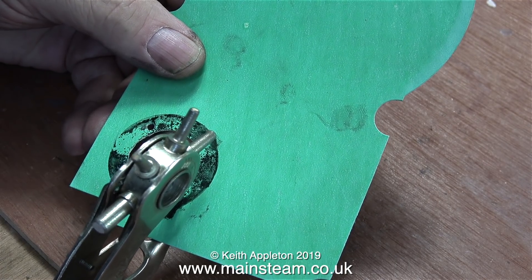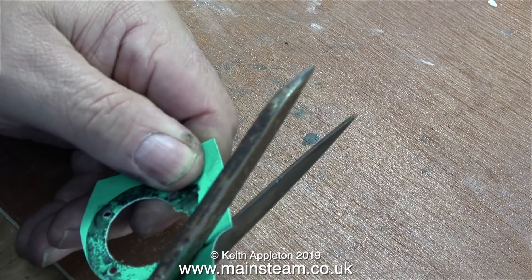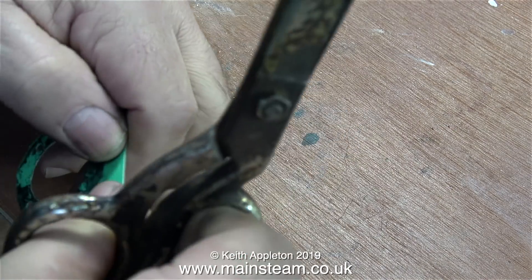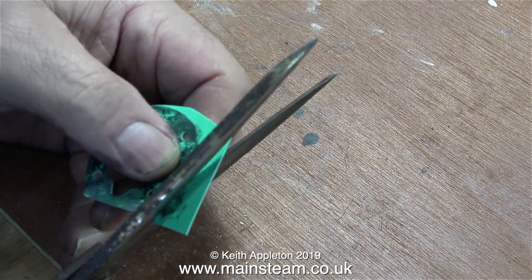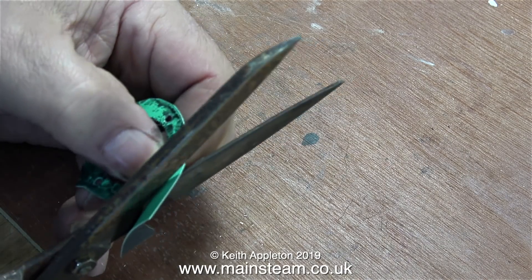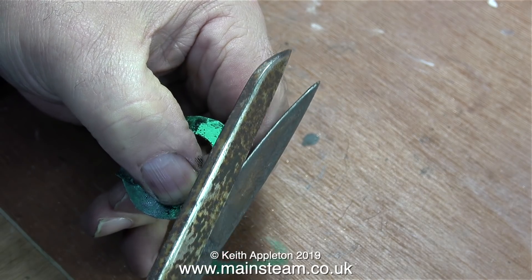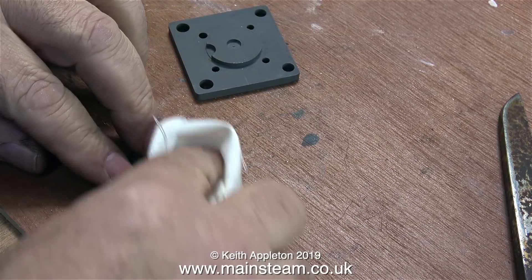Once I've cut out the centre, I just punch out the hole positions, followed by cutting the outer part of the gasket. Normally I would use a very old pair of scissors to cut out parts like this — I don't much like the modern plastic ones because they usually break. These scissors really are quite ancient, but they cut out the gasket perfectly. Normally I wouldn't bother too much about cutting the outside of a gasket because you can trim it with a craft knife once everything is bolted in position, but on a beam engine you can't do this successfully. With the cylinder mounted to a painted mounting plate, trimming the gasket would mark the paint, so I'm undercutting the gasket all the way around very slightly.